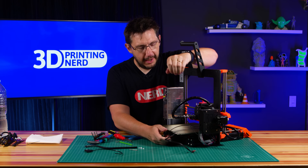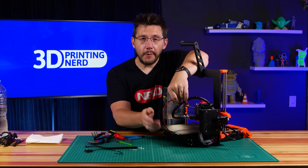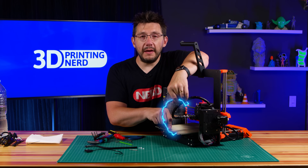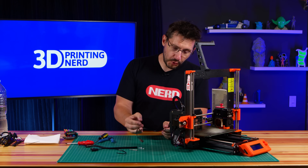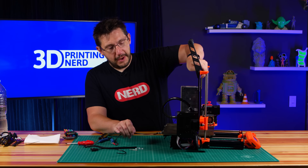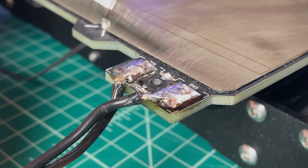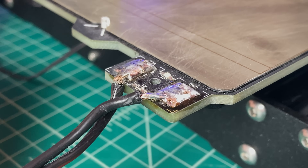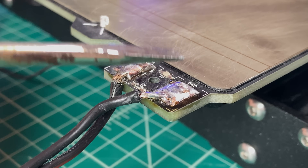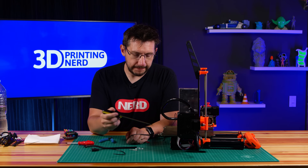Here's the bed. This is the thermistor cable — it's attached under the bed and tells the printer how hot the bed is. These are the power wires, and these are what provide the energy to the bed for it to heat, and this was the nylon — that's what's inside the Prusa bed wire. Now that it's freed from the control board, we have one step left: desoldering the wires from the pad. These are the solder pads with a lot of solder on each one — this is positive, this is ground or GND. I'm going to heat up my soldering iron to desolder the wires and leave as much solder as possible because we can use it when we put the new wires in.